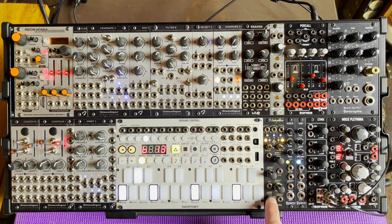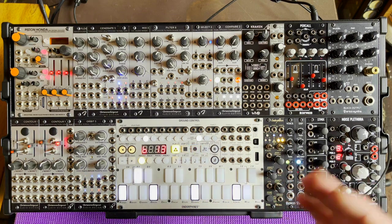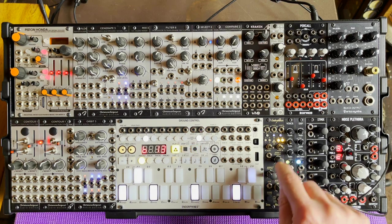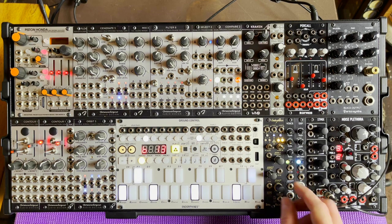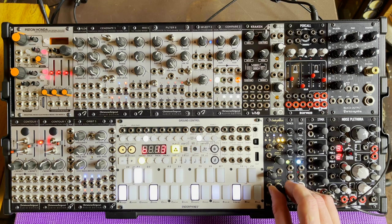The way it works is when you cycle between the LEDs here, you're no longer cycling between presets, you're cycling between outputs, right? And what that does is it allows you to set the minimum voltage and the maximum voltage for each output. And that you do using these first two knobs over here, right? This one is minimum and this one is maximum. It even says there, macro minimum, macro maximum. And then this is the macro all knob. You can manually morph between the three outputs' minimum values all the way to their maximum values, right? So this can be very interesting.